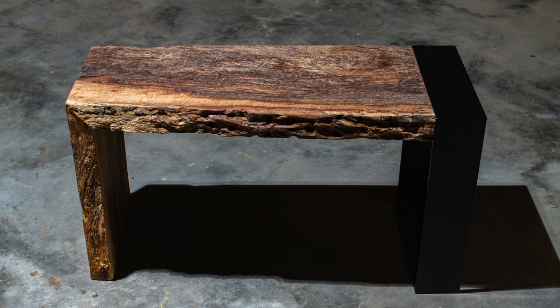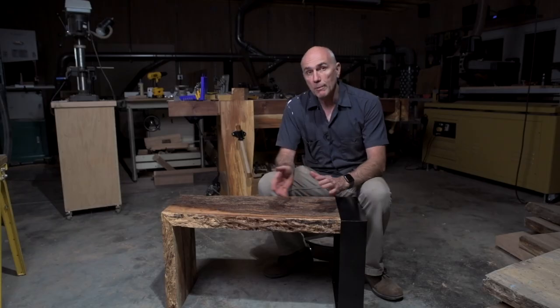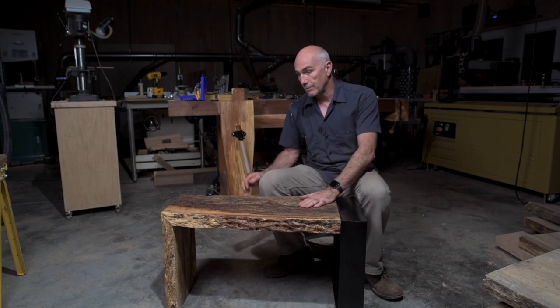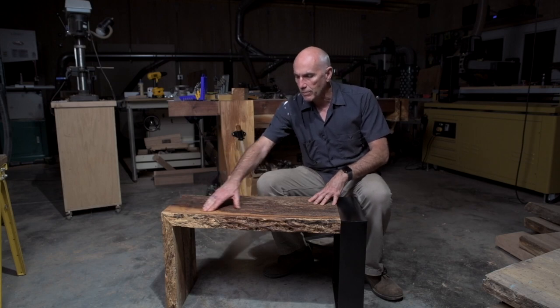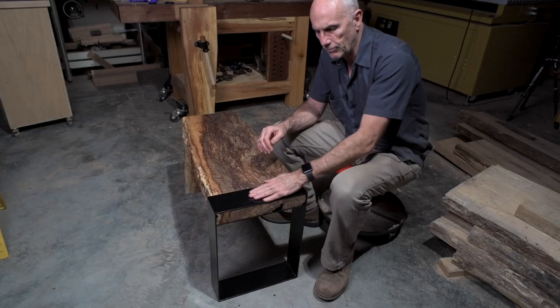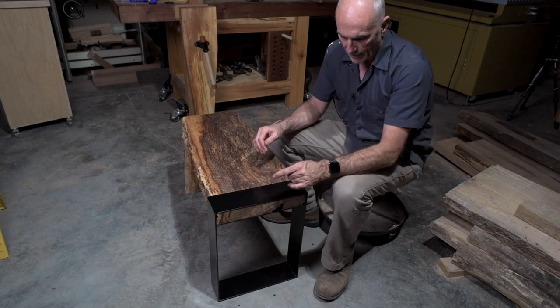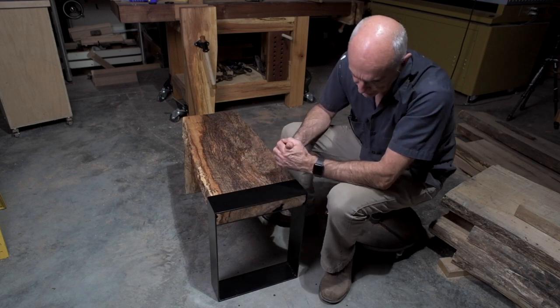There you go, it's all done — it looks very nice. The live edge is nice on this side, the figure on the top, and it meets up nicely with the waterfall edge. I ended up using Danish oil. There are a couple of reasons I wanted an oil finish: one, it would soak in and harden up some of the wood that was a little soft on the vertical part, because this is a spalted piece and spalting is right on the edge of rotting away. It also brings out the curl in the lighter colored part of the wood. What I'm not so sure about is how thin these legs are — they're plenty strong, that's not the concern, it's more of a look. As always, thanks for watching, hope you enjoyed it and we'll see you next time.